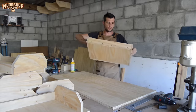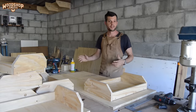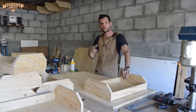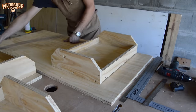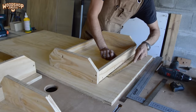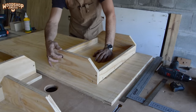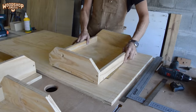So these are the bins and they will ultimately be fixed to a backboard like this. The backboard will be fixed to the wall bracket using hinges, giving it the ability to swing up and down. But a critical part of this design is the fact that the bin needs to stay horizontal while the backboard changes from a vertical or open position to the horizontal or closed position. To achieve this, each bin will be fixed at its rear using a piece of piano hinge. A small step was created here by installing this board slightly higher, to accommodate the piano hinge. This will create a pivot point allowing the bin to rotate. A secondary pivot will be installed at the cutout and link up to the wall bracket, and it will be this point responsible for keeping the bin level as the backboard is being folded up and down.